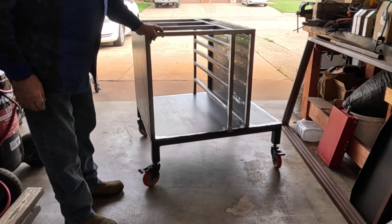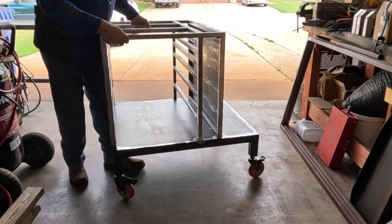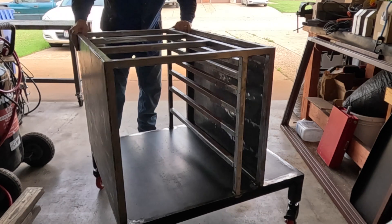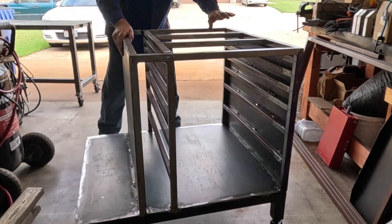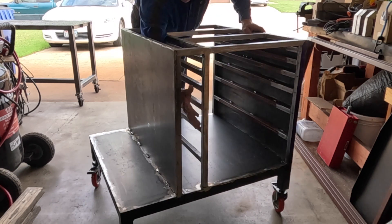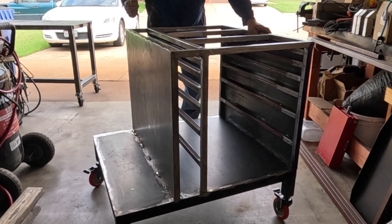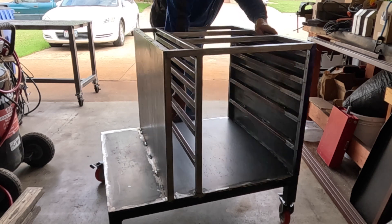I wanted to give you a closer view of the welding cart thus far. You'll notice I actually did get the outside panel on - tacked that on this morning. I've got the rail guides and everything, that's all in place. Getting the next sheet tomorrow morning that goes in here against all of this, and we'll tack that from the back side, tack it on the zip-welded on the ends, and at the bottom as far as I can reach and then down across the bottom inside.